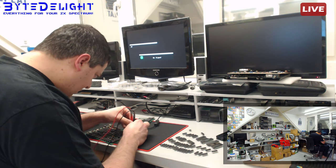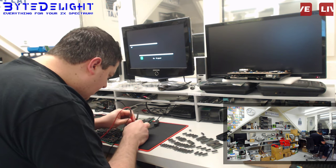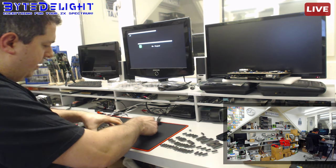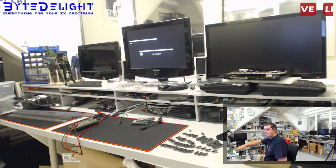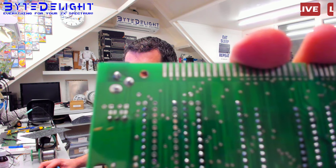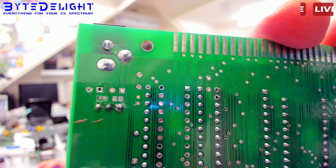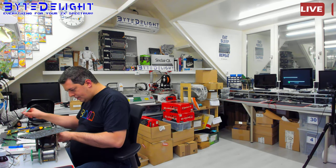This is so odd. We have 9 volts. Yeah, we have 9 volts, so 9 volts is going in. At this moment, although I really don't like it, it does seem that the pin on the voltage regulator, I just noticed it a couple of minutes ago, is not soldered on correctly. And I did a couple of resolders, so I think it's the second problem then that has occurred. But you can see that the 5 volt pin is actually quite open. I didn't check it well, so my bad.